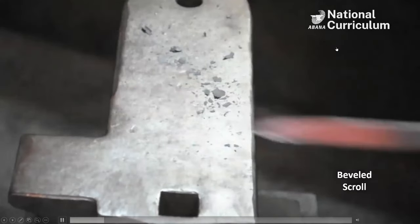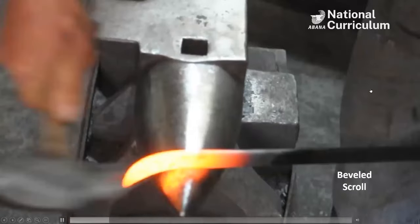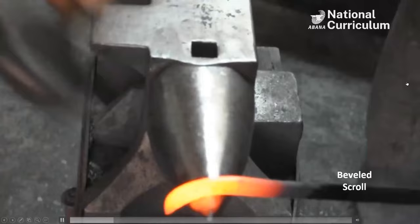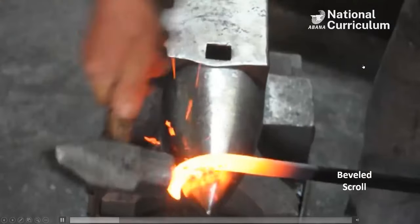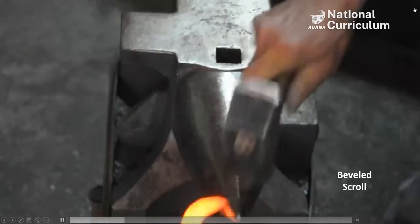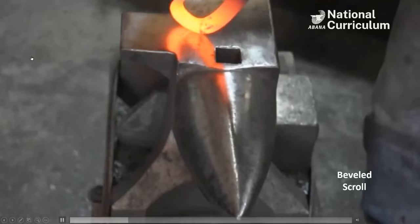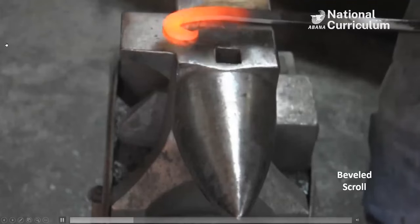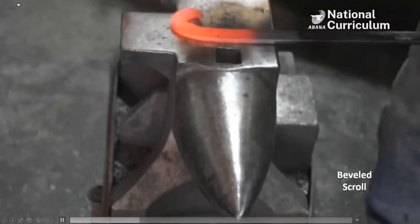That's about the shape you're going for. Then you hit this — I need to work on the base of my anvil; you can see it's moving if I hit it from the side. But it worked, just took me one heat more because the anvil was giving. Turn it over, curl it in a little more. Now you can go to the flat side. It moved a little bit out of view, but I guess you get the idea of what I'm doing here. Curl it in, straighten the lower part, back out again.